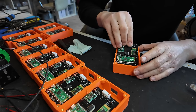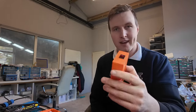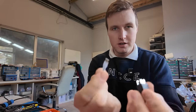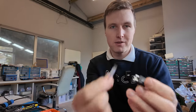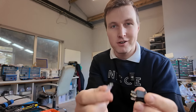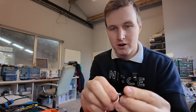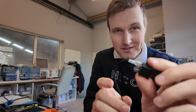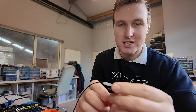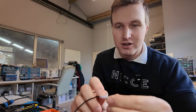That will be ten — ten cases finished. Now we need to mount the buttons that go inside. It is a fairly straightforward process — I'll show you one and then get on and do the rest off camera. Our buttons need to be removable so that we can swap out the PCB, so we use little crimp lock connectors. These are quite expensive, especially when they come pre-wired, but I'm willing to pay for it because otherwise this would take a long time. We just push them on to the buttons. Once they're on they are very much as good as soldering — almost too good at staying on.